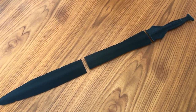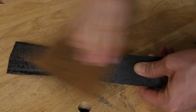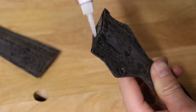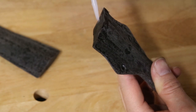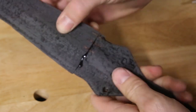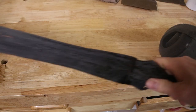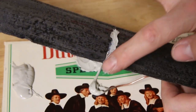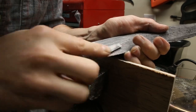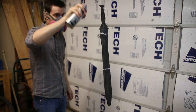All 3 sections turned out very nice, but they still needed a lot of sanding to remove the lines made by the printer. I sanded each piece individually and then glued them together with superglue. I was concerned that the glue joint wouldn't be very strong, however it turned out to be extremely strong. I used some Bondo to cover up the glue joints and then filed and sanded them smooth. Then I sprayed the pattern with primer several times, sanding it smooth after each coat.